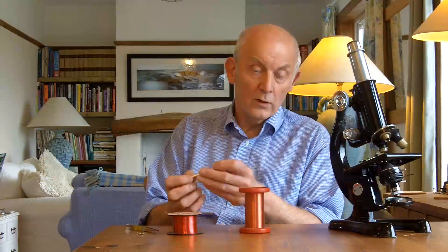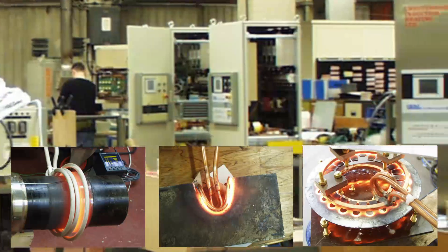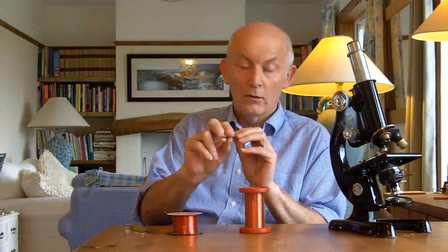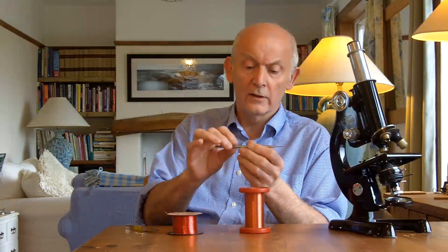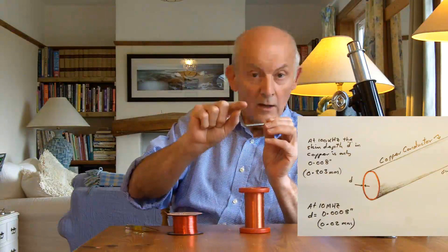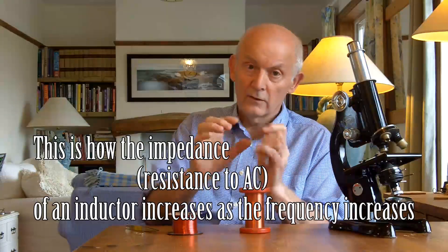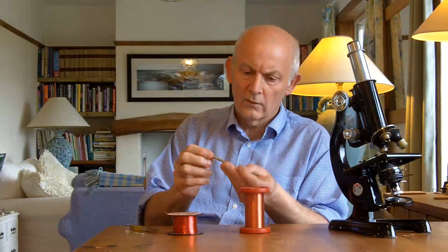Most of my work was in designing and manufacturing radio frequency induction heaters, mostly at around 100 kHz. If this was a copper conductor carrying 100 kHz, the skin depth — the depth at which the majority of the current would flow — is in the first 8 thousandths of an inch. It's called skin effect. It doesn't matter if this conductor was 25 mm in diameter; it would still only get current travelling around the outer surface, to a depth of 8 thousandths of an inch. A 2-inch diameter conductor is still going to travel in that skin — that's just one of the laws of physics.